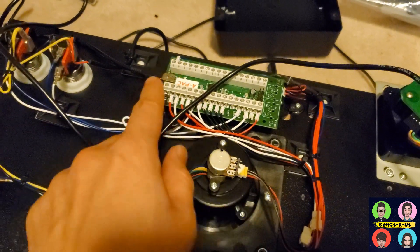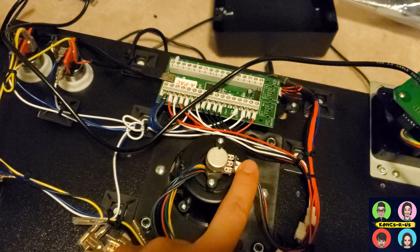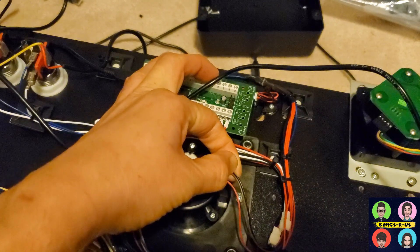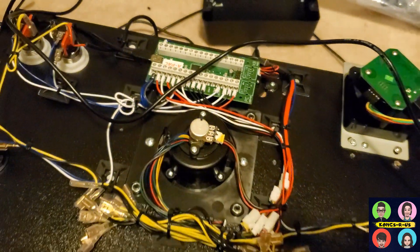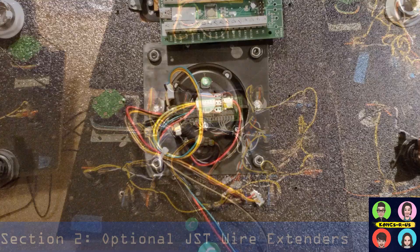You can rewire it and put your ground for the black wire in here, like I did. Look carefully where it's coming out of — from your potentiometer, the top wire is your ground no matter what color it is. Make sure you make that your ground and hopefully that should fix any issues for folks having trouble with their X-axis potentiometer reading correctly.